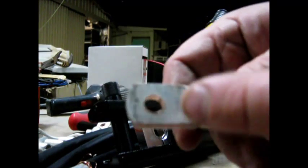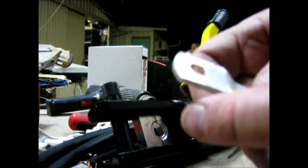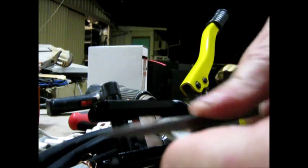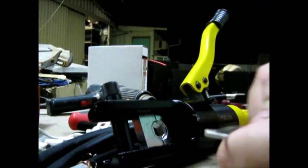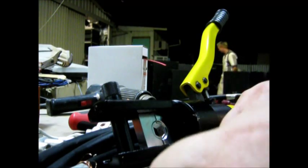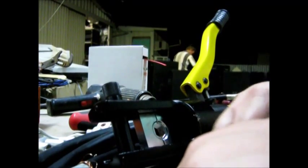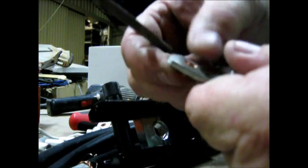Another thing YouTube — when you drill them out, there can be a little bit of a burr. That will stop them connecting to the battery properly. All I've been doing is getting the file and giving it a bit of a file so it's flat, so it touches the whole battery terminal and just takes the burr out. Nice and flat now.